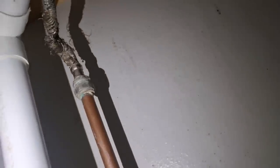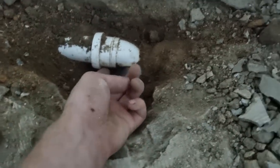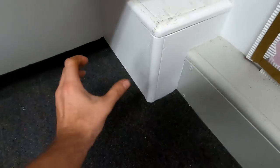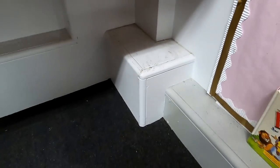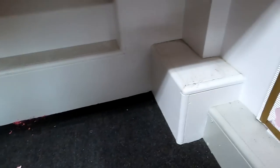That is why I don't like flexes. I don't know how that's never leaked — it's really wet down here. The job is to investigate a drain smell; it absolutely stinks in here. When they had the drains jetted, all the water came back up through here, so I'm guessing there's a waste pipe dropping from that sink unit and there's no bung. The floor's been soaked and it's been stinking for a while apparently.